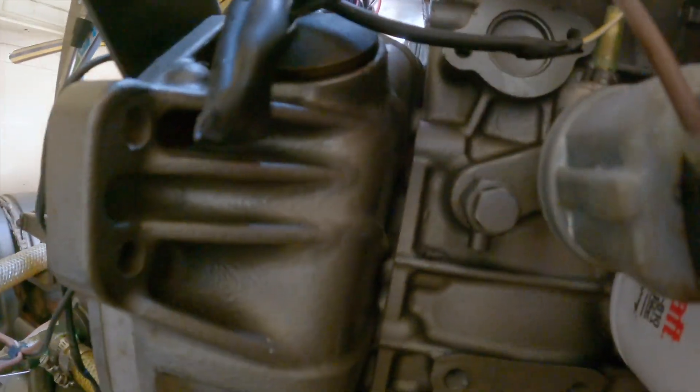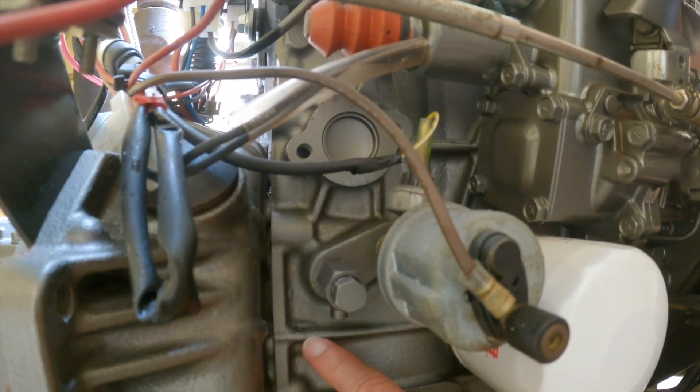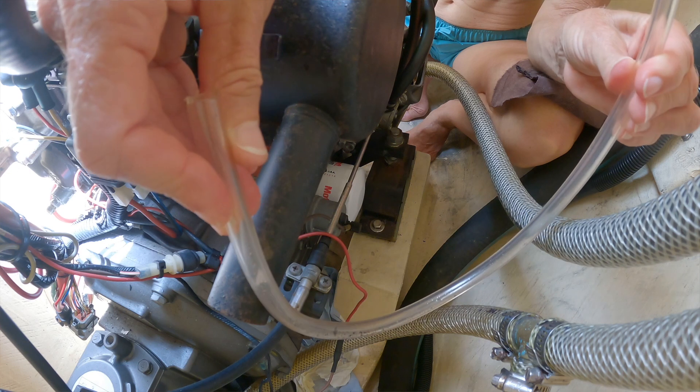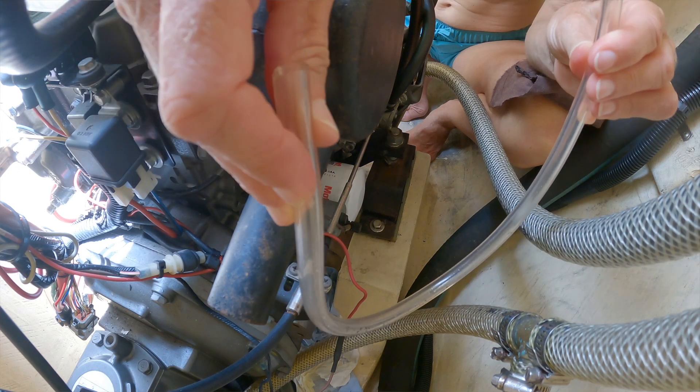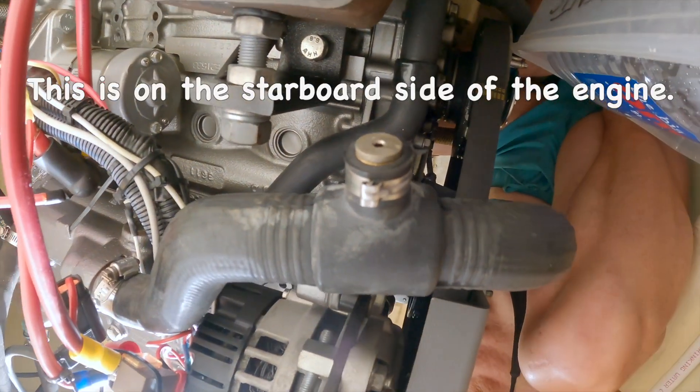Right here is the plug we're going to be taking out, and right next to the engine is an area where you can connect a hose so that you can drain some of the coolant. This is where the hex key goes. There's no little tubing to attach to, which is kind of annoying, and there's not a lot of room — you can't fit a jug, so you have to use a bin. Hoping there's not a lot of boat traffic so our coolant doesn't go sloshing.